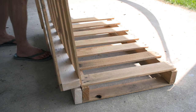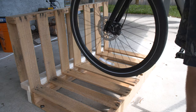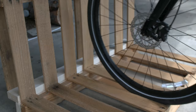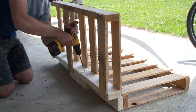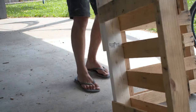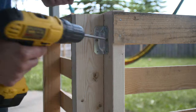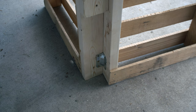Once that's done, you can stack the other pallet on top of those two pieces of 2x4 — you'll see that you've created a nice flat surface for it to sit on. At this point, do a test with your bike to make sure the bike tire is going to fit in place. If it's fitting nicely, proceed to the next step. If it isn't — since all pallets come in slightly different sizes — you may need to make some modifications; that's why it's a good idea to check now. Then fasten the top pallet down to the 2x4s using screws along the top. For additional support, I also added 90-degree corner brackets to the bottom of the added 2x4 and the 2x4 of the top pallet. In place of metal brackets, you could use pieces of wood as well, depending on how many bikes you have.